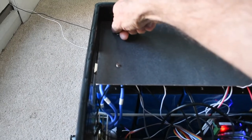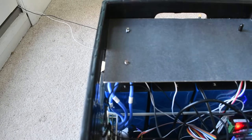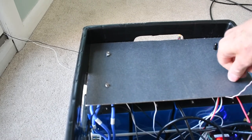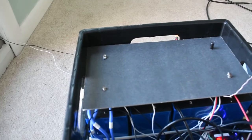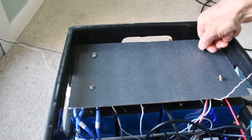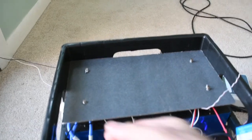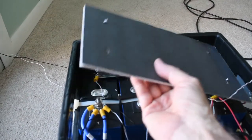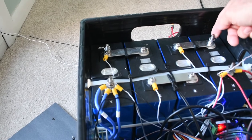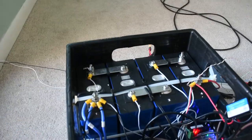I was a little nervous about shorting out anything to the battery when working on it. I didn't want to drop a tool or USB cable that would cause a short to ground. So I put a cover over the top using four longer stainless steel bolts in the corners with the heads ground off, making them into studs. Some folks recommend these on all the terminals of prismatic lithium iron phosphate batteries since they're known for stripping out terminal lugs.